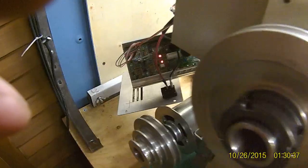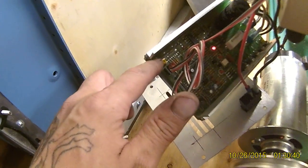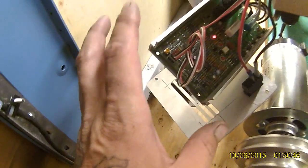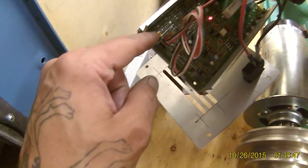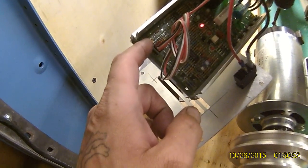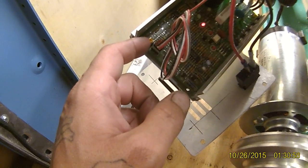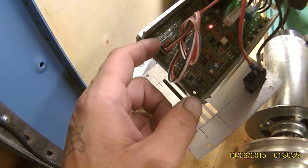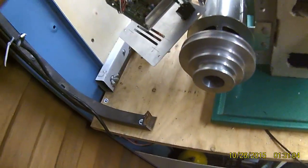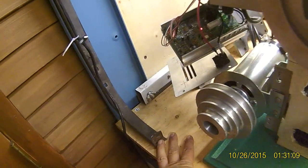That's all there is to it. Once you have everything set up, put this on the lowest level with the speed sensor. Keep in mind that when you adjust the sensor, your lowest speed also affects your highest speed. Say it's 100 RPMs when bottomed out and you turn it up to 200 — it could take your high speed from 1,500 to 2,000 RPMs. So you have to check both positions and find a happy medium.